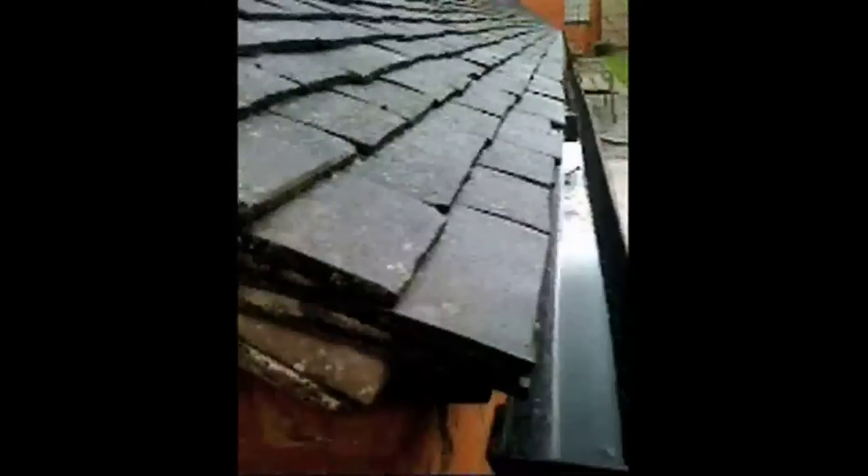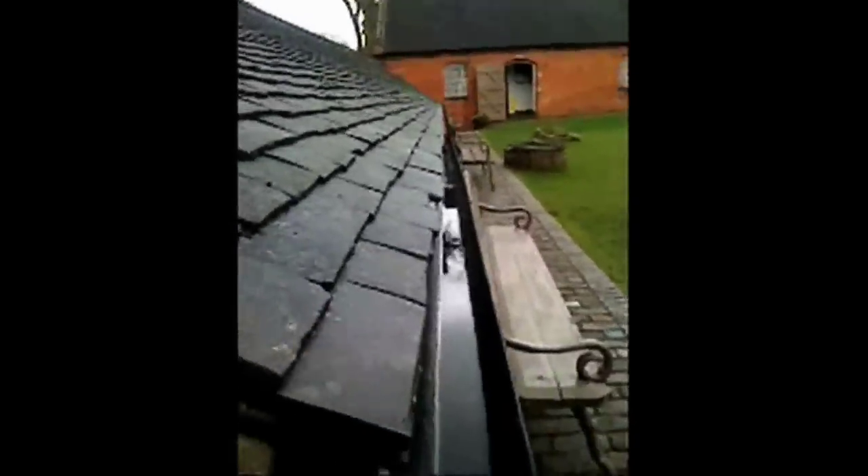It acts all the way down, so you can see there are always three tiles — the top course, the under course, and the bottom tile — always draining the water out. This is a good way of seeing it: here you can see that the tiling has been thrown away from the main course of brickwork, which goes out into the gutter.